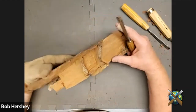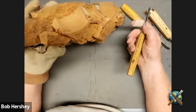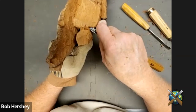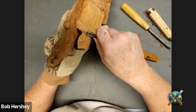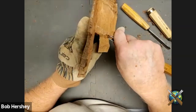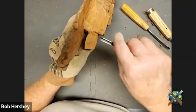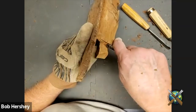Okay. Now I'm going to separate this chimney from the roof line, and I'll take my 16-6 in here to do that. And here again, I'm not just forcing it in here. I'm working with the right edge of the V-tool. Now I'm going to come back and use the left edge. Now the right edge, and then the left edge. That way it always has somewhere to go. If you just force this thing right in there, that big hunk of steel, you could make one big gigantic cut and force that in there, but it is going to bust out. I will guarantee you.